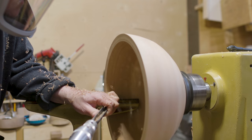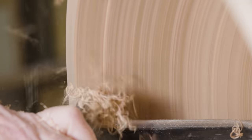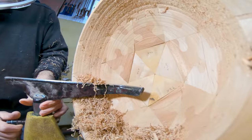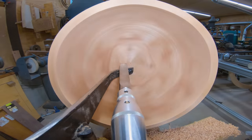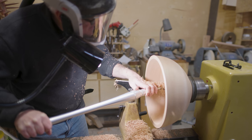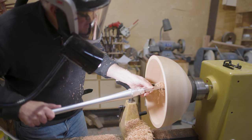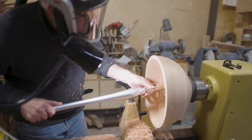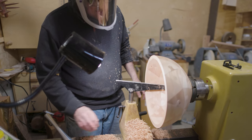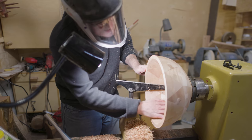And start on the inside. I started by getting the area near the rim done first, as this bowl was going to have fairly thin sides. I think I was a little more afraid of it vibrating a lot and it turned out not to be too big of an issue. Once I did the shape pretty close I got the scraper out and I could make the surface on the inside nice and smooth. My skill with the bowl gouge on the inside of the bowl still isn't quite good enough to get a really clean surface, so I used the scraper to clean everything up. I find I can run my fingers over the inside and feel where the ridges are, and sometimes I'll even mark with a pencil where the ridges are so I can see them while I'm turning, because they kind of disappear when the bowl is spinning.